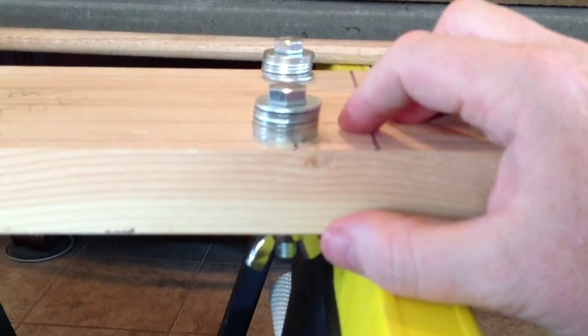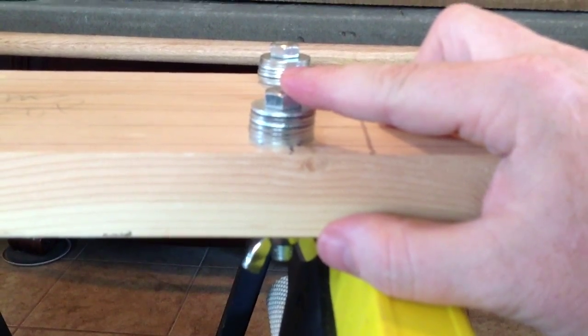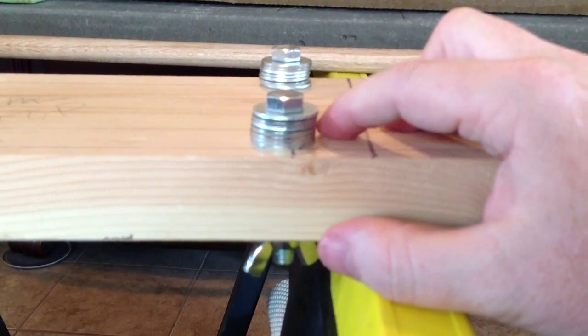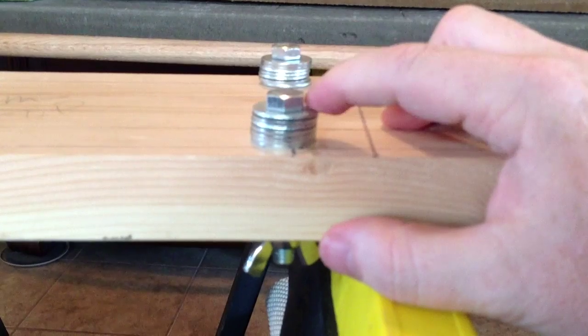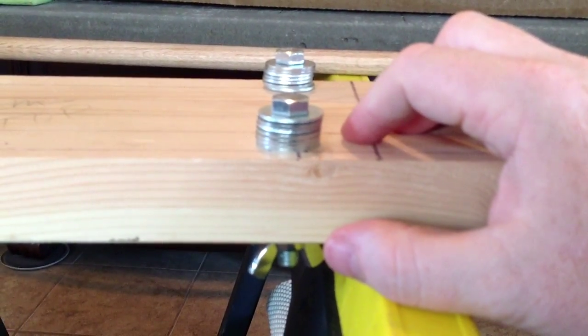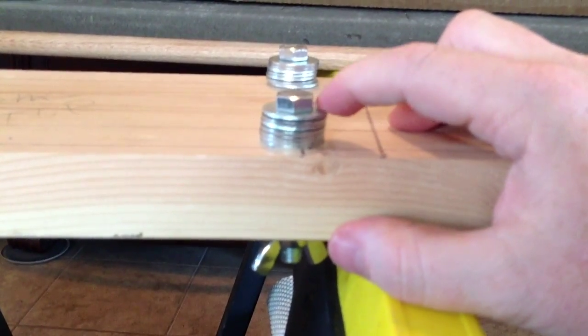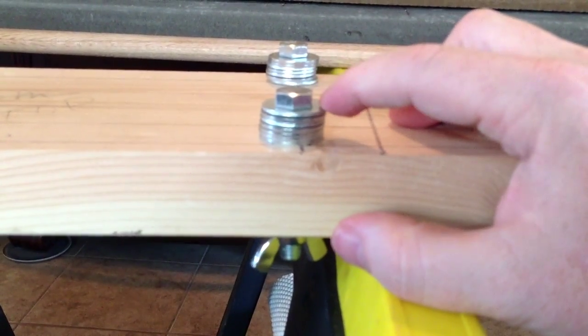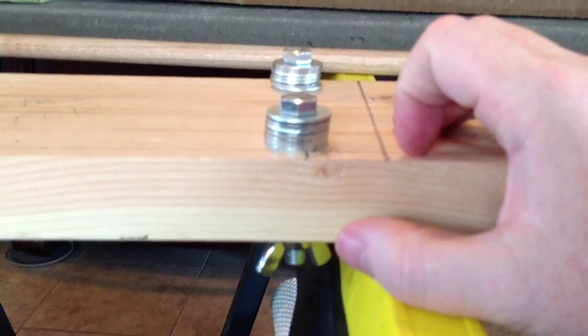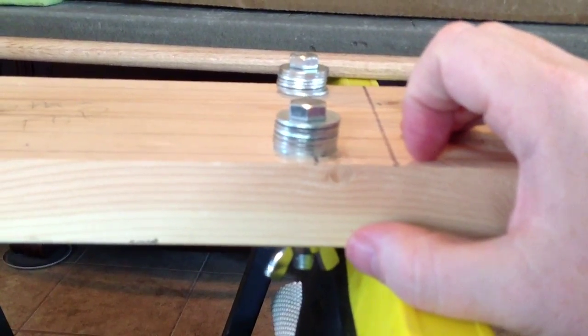If I want to go to one inch, I add three more washers on top, so ten washers total equals one inch. It makes it easy for me to work with both sides when flattening, taking notes and adjustments. I can say it was seven washers deep, six washers deep, eight washers deep, depending on what I want to do. And it's consistent — I know if I've got seven washers on both sides, I'm getting a consistent flattening, not dependent on me screwing the jig down.